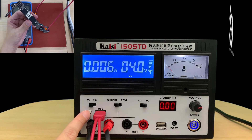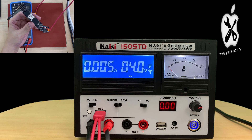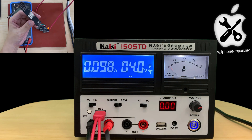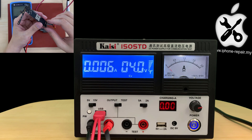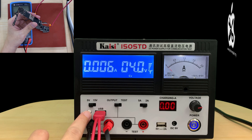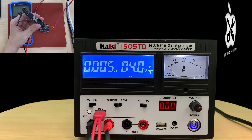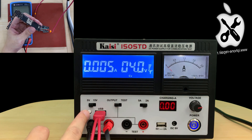So I press it, and you will see the current flow. This is considered self-testing. Just press it lightly one time and you will see it load about 100mA, and then it drops back. Give about 4.0V and press it on one time — 100mA, drops back to 0. This is how we test the current. If you press it a second time, it should turn on.